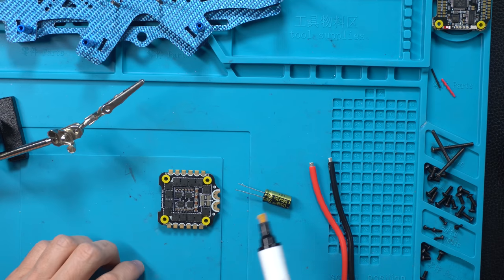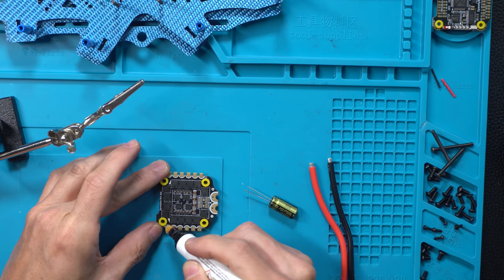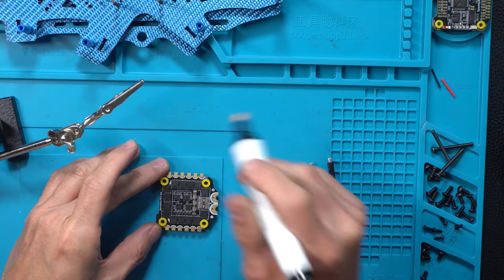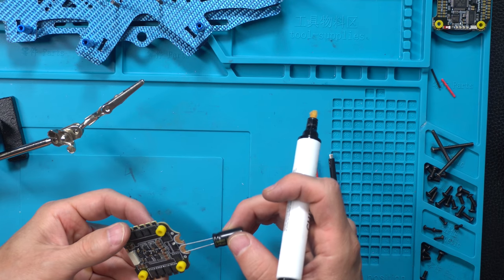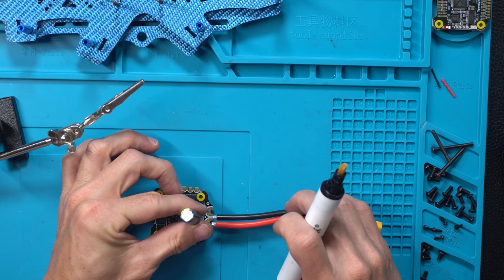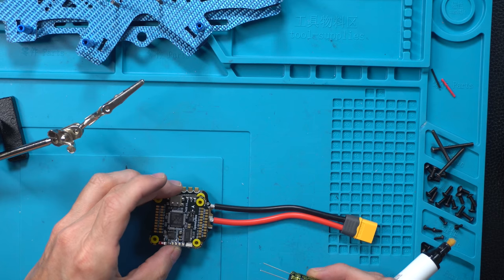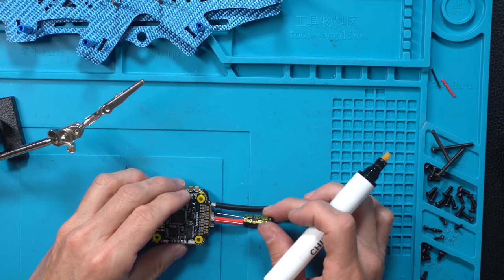Before we get started with soldering, always a good game of what to do with the capacitor. I'm going to put a little flux over all these pads right here. I'm going to take the capacitor and shove it through these little holes, flip it over, put a little bit of solder down so that holds it in place. Then when I'm ready, I'll put the leads on and bend it on top. That'll still give me plenty of space between the flight controller, which has a port only in the front and back.